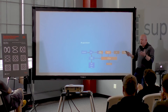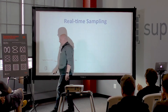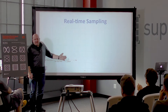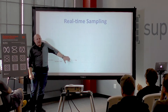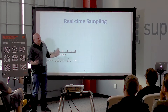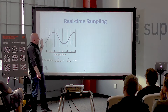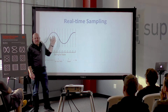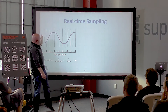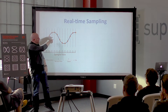In a real-time scope, let's say we have a sample rate of one gigasample. Take the inverse of that and you get the sample period — so a one-gigasample A-to-D samples our waveform every nanosecond. Today that's kind of slow; fifteen years ago that was fast.